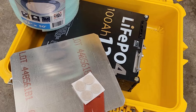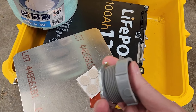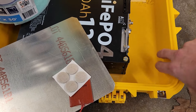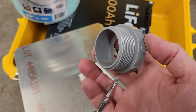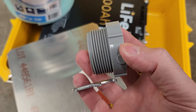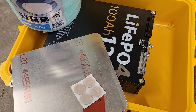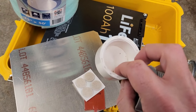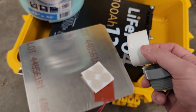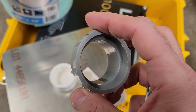How I usually get the solar charging wires and whatever I'm plugging into this out of the box without opening it is I use these electrical PVC fittings that I can install a lock ring on. I basically drill a hole with a hole saw and use the electrical fittings for two reasons. They come with these nice lock rings, and unlike plumbing fittings which have tapered threads — meaning a cap gets tighter and tighter and can get stuck requiring a strap wrench — the electrical threads are not tapered. Once it starts getting snug you just leave it and it pops right off.